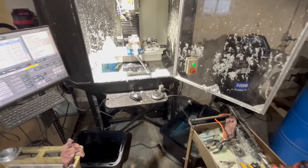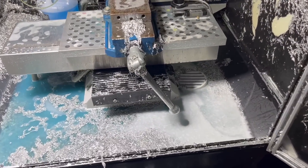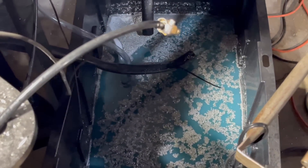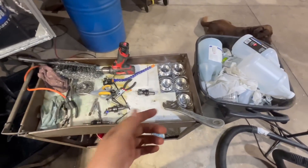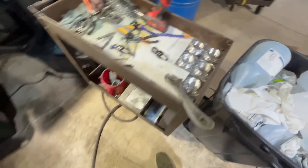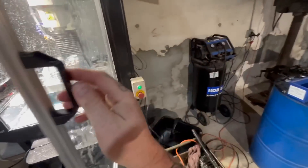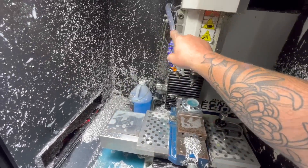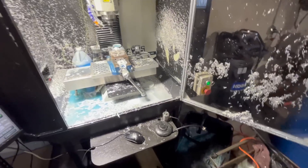We're a whole day down using the new flood coolant setup. It is building up a little where it has to overflow even though the holes I drilled are still draining. We do have a lot of chips in the fluid, but I've done a lot of machining — we're taking a big chunk of aluminum and turning it down to basically nothing. So I think I'm going to put in a bypass valve so I can pump all the fluid out and then vacuum out all the chunks.